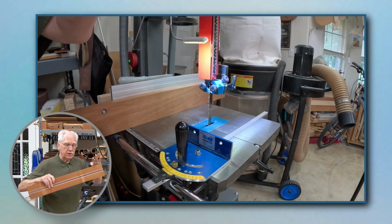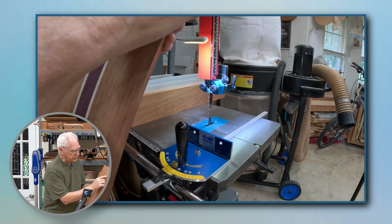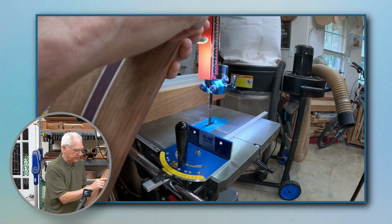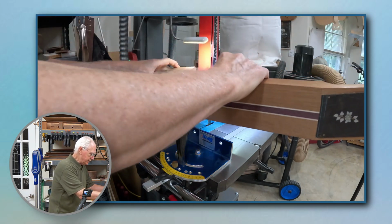Peg head overlays on. The peg head itself is down to 9/16 of an inch, and I have marked my location of my 14th fret and then where the tenon is going to meet. So the 14th fret is here, and then I've added 1 more inch. I just need to trim the end of this neck blank so I can get on with the next process.